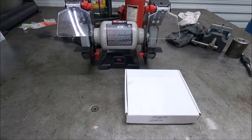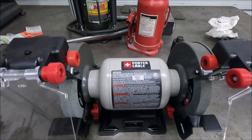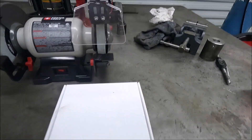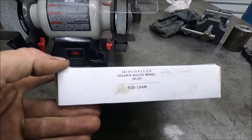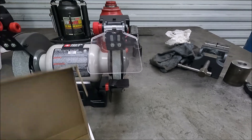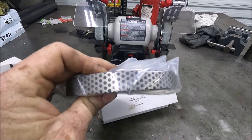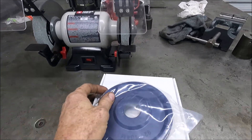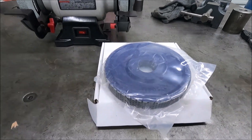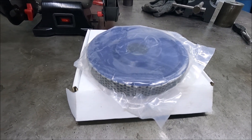How I'm going to do it is with a six-inch bench grinder. This is just a cheap six-inch bench grinder from Lowe's, and this is a diamond wheel that I got from McMaster-Carr. Apparently this is how Lincoln Electric actually does this, and you can sharpen thousands of tungstens on one of these wheels.